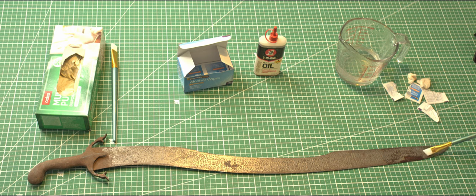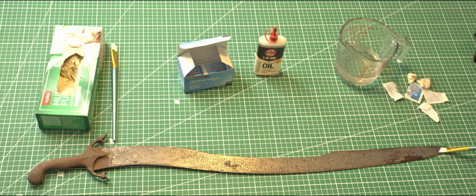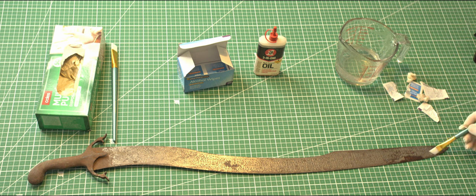There's a very large temperature differential between the gel — which is at the moment around 70 degrees Celsius because I just heated it — and the blade, which is room temperature and made of steel with a very different thermal coefficient to water. As a result, the moment I am touching the tip of this paintbrush to the blade, it is gelling up quite rapidly. The gel is not spilling off the blade nor around the edges to the other side, which means we can stay relatively localized in our applications to one surface at a time.